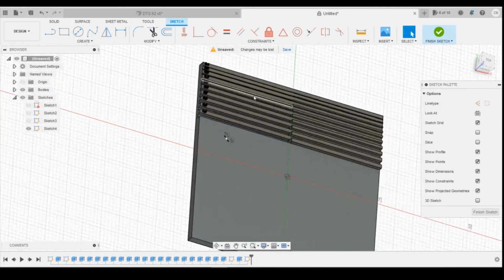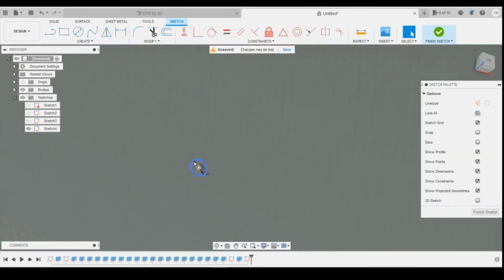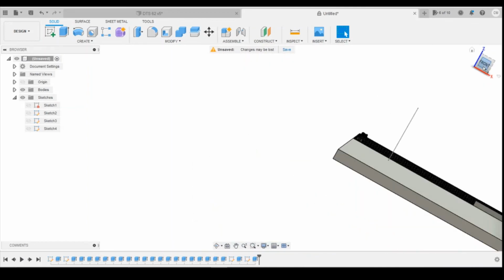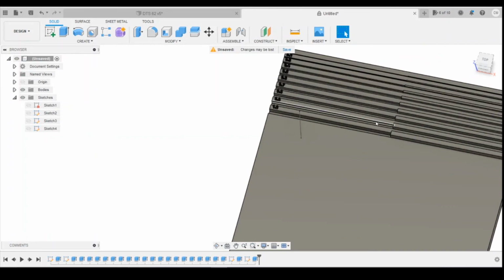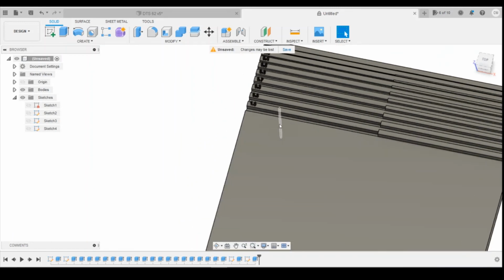And again, just remembering, just because you can print something that's maybe 0.1, 0.2 millimeters thick, doesn't mean that I can then start taking this 0.1 millimeter circle here and extruding it 5-6 mil off the bed, or even worse, 10 mil off the bed, and expect that to print in the first place, and be strong enough that it's not going to break. What we're looking at here is surface detail, so rivets, wooden planking, tiling, grout work, that sort of thing. Not necessarily just can I print a pipe that's 0.1 millimeter thick and expect it to work, because that pipe generally is not just going to be attached to the side of something.